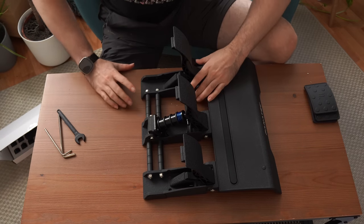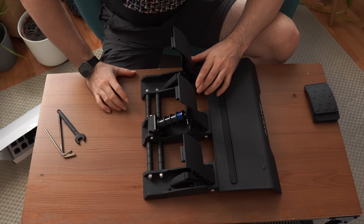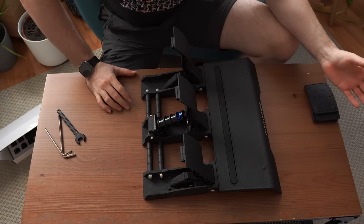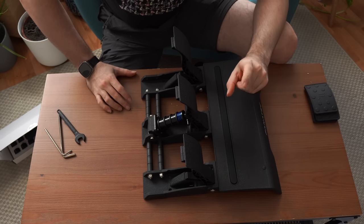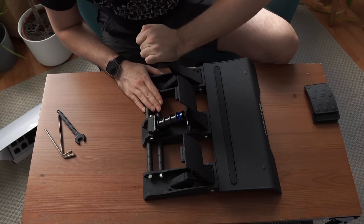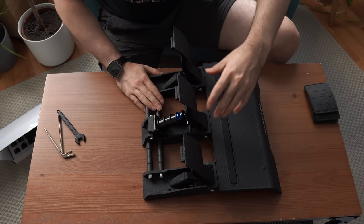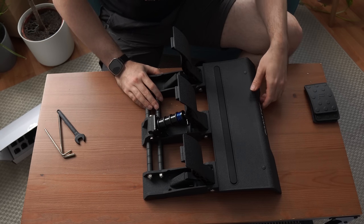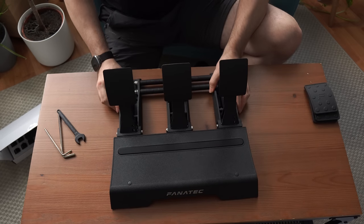That's nice because they generally require less maintenance than potentiometers. And the potentiometers on the previous pedals, I didn't have problems with them, but over time they could collect dust and you'd have to squirt the dust out with a bit of compressed air. Most people will think that Hall effect sensors are nicer. There's pros and cons to them. I like Hall effects. I like potentiometers as well. I don't really care. If it works, it works. That's my view. Anyway, there's the CSL Elite V2.